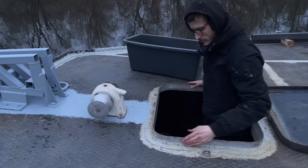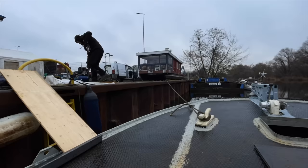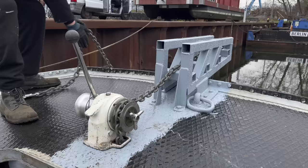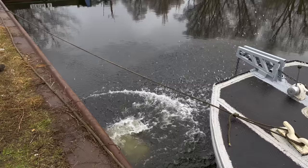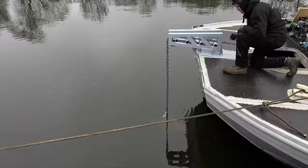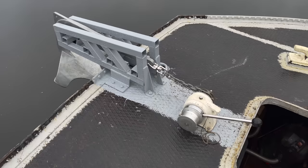I use this black plastic box to hold the anchor chain. Now it's time to get the chain and the anchor onto the boat. I feed the chain through the hole of the windlass into the black box, then I take a few meters of the chain and guide it through the anchor holder. I attach the chain to the anchor, give it a little bit more chain, and then throw the anchor in. If all went well and my design works, all I have to do now is pull the anchor up with the windlass. Getting the anchor itself over the edge of the structure back to safety requires a little bit of help, but we'll figure out a solution for this in the future. And that's my quick and easy solution to get an anchor on your boat.